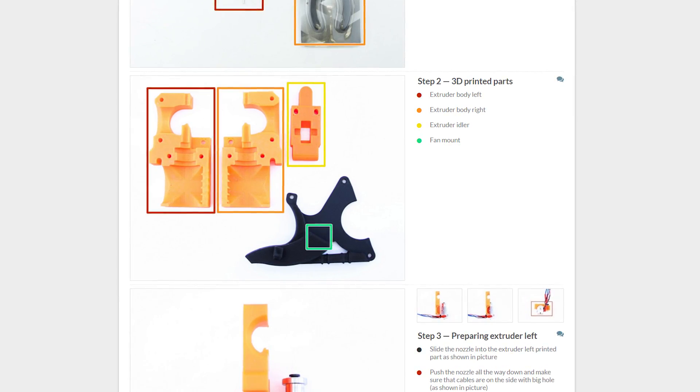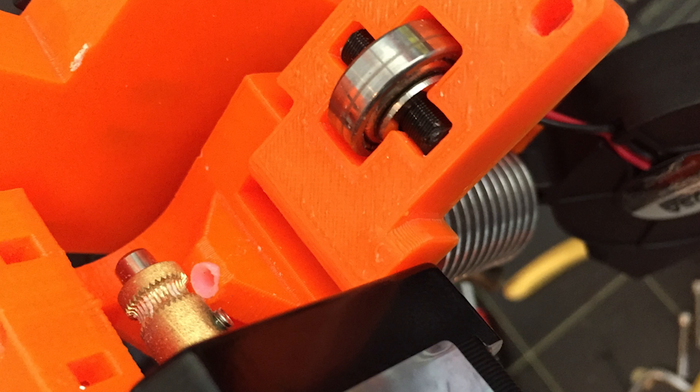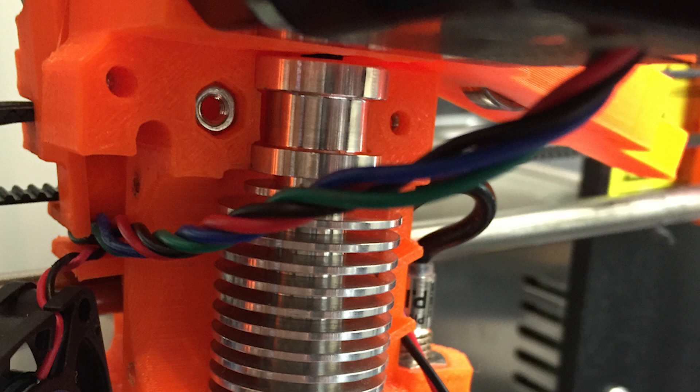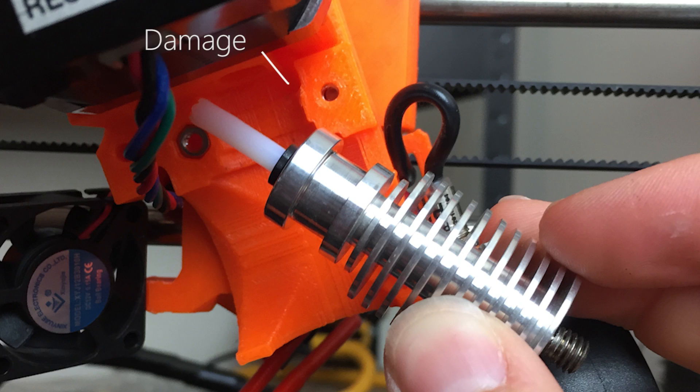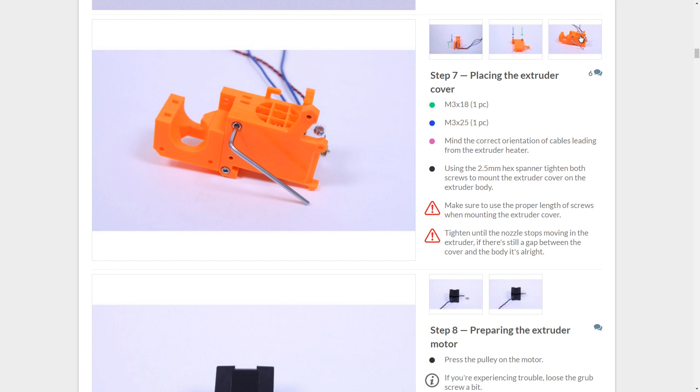I did also experience a filament jam during my test when the withdrawal of filament didn't go quite as smoothly as I would have liked, and I found the process of removing the extruder actually fairly tedious. It looks like the block that holds it in place used to be two parts in the original i3, but now it's moved to a single piece for ease of assembly in the MK2. It's no issue during assembly — you can just slide the PTFE tube through the top hole — but to remove it you can't get access to that catch, and you have to sort of forcefully yank it out of the block. Once things were cleared, however, it went back together perfectly following the excellent online assembly manual and photos.